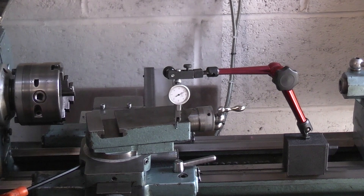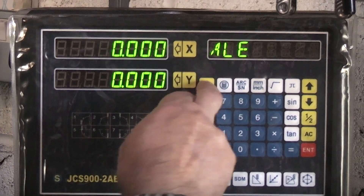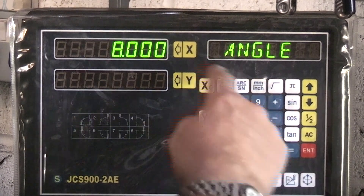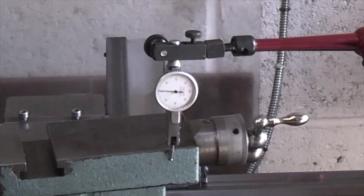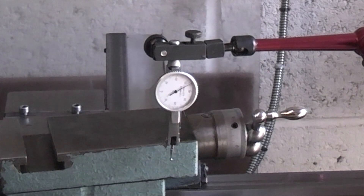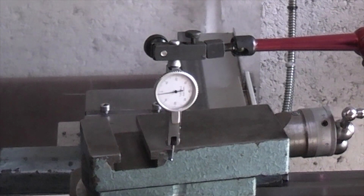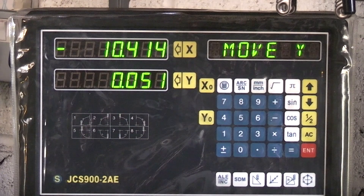These digital readouts are now set up to give me a true reading instead of the diameter of the bar I'm turning. All I need to do when I want to go back to lathe use is just set it up to diameter and swap the plugs round into X and Y. This is the setup — magnetic base holding the dial indicator, set to roughly eight degrees. Then all I'll do is turn it in, get to zero on the box, exactly the same as on the milling machine. Zero zero, enter XY, enter the angle is eight, move down and it says move X. Then all I do is turn it in, move it along until the dial indicator comes back to zero. Press Y — 0.051 millimeters out. So you can use the display to set your compound slide.